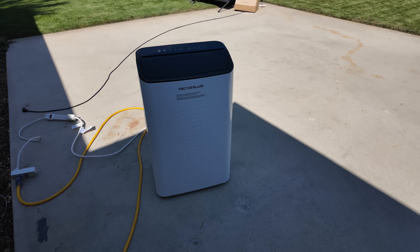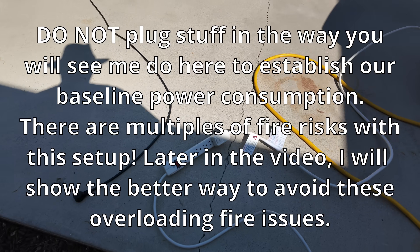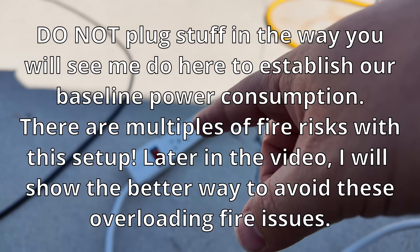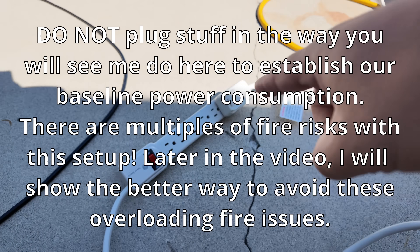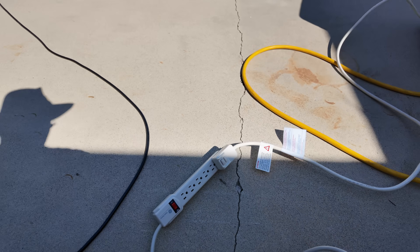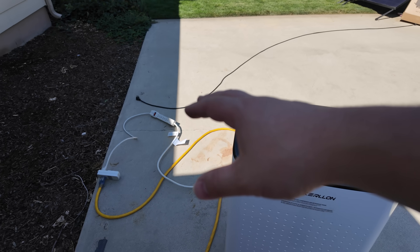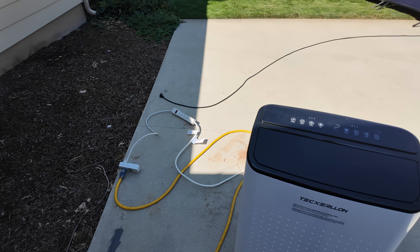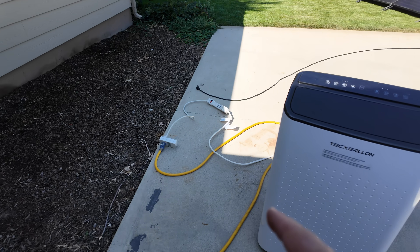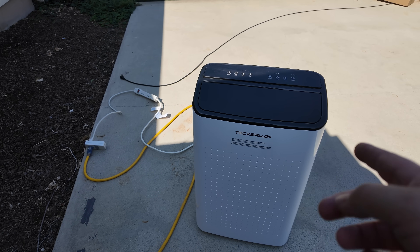Let's get a baseline power consumption on this 15,000 BTU portable air conditioner. I'm using this power strip so that I can connect both the air conditioning unit as well as the solar together on the same line. Definitely do not plug your portable or window air conditioners into a power strip — that's just asking for trouble. I'm going to show you a safer way to avoid overloading anything. Yes, I realize I'm running an air conditioner outside, but this will make it easier to show you what's going on, and you can picture the air conditioner inside your house with a simple cord running in from outside.